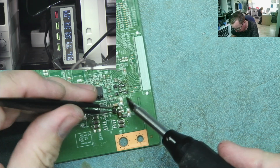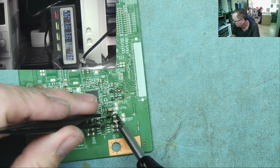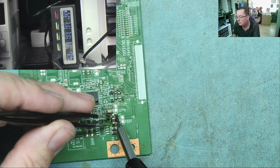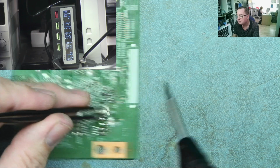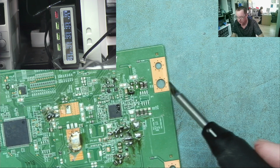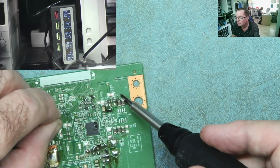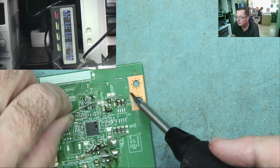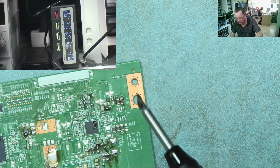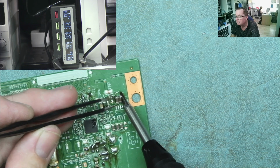Can we unsolder this? So warm both ends at once. Yes. And quite easily actually. Another one. Bit of leaded solder. Okay. I won't put the flux on this time. See if there's enough on here already. Oh yeah, look at that.